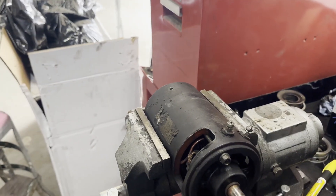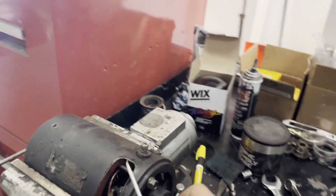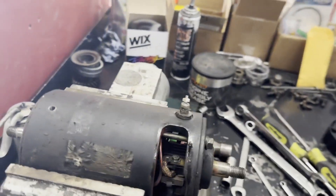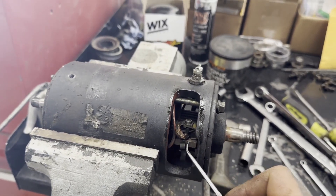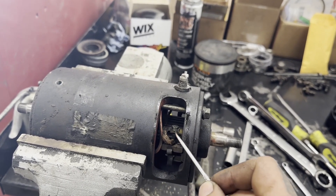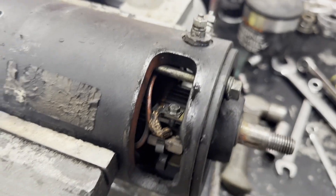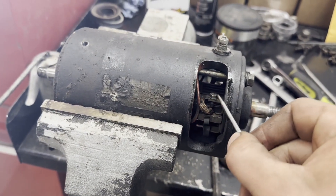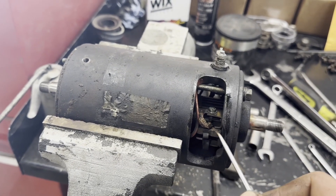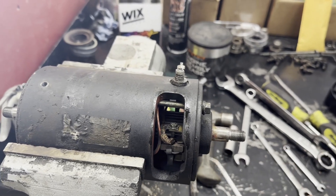The first thing I want to do is get this cover off - it's got two very long bolts that go all the way through the body and connect to the back plate where the rear bearing is housed. But first I'm going to have to take the brushes out. There's two of them, one here and one on the other side. There's a spring clip that holds this side on and then it's bolted in here - normally flat head screws, but this has quarter inch bolts. So we're going to take the springs off and the ground strap and then these will slide right out. Once I have both brushes out, I should be able to undo these long bolts and sneak this guy out of here.